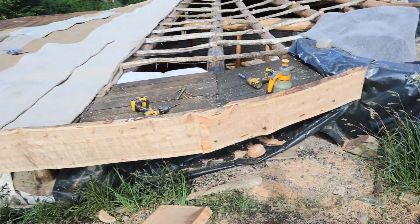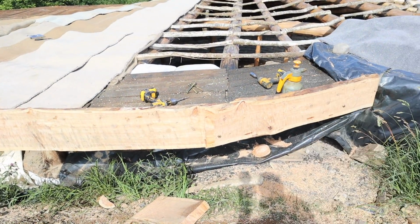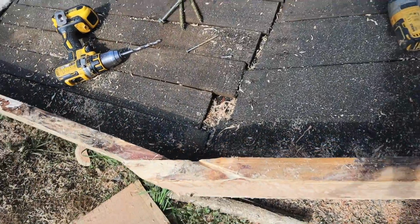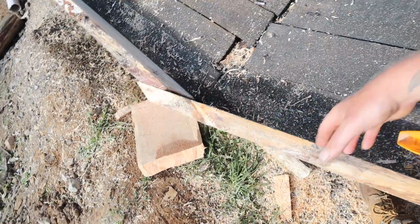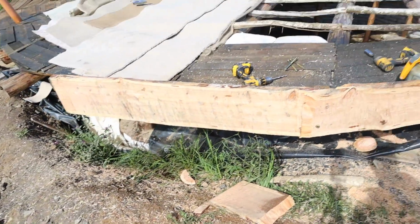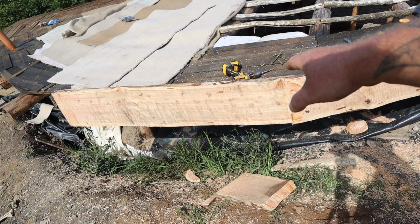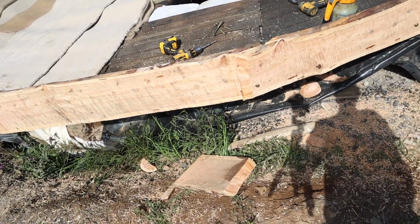Okay, that's how we do them. That's the first one up. I can come along and clean them up with a little plane or something if I want to afterwards. It would have been nice to have a bit more heartwood up here, but it's going to be okay. I'll treat them from the backs and stuff. Because like I say, this will actually last like 15 years, maybe even more. But only the heartwood, the sapwood won't. The sapwood will rot away.